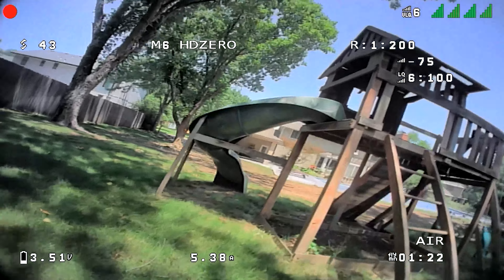I think they're trying to drive towards that three-minute flight time, but it's too low because you're going to end up with the camera powering down when you get too far below three volts — and that happens pretty quickly. With these little 1S batteries, especially if you're flying aggressively, once they get down to about 3.1 volts they go from 3.1 to 2.9 and lower pretty darn quickly, so you need to bring it in.